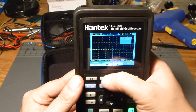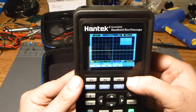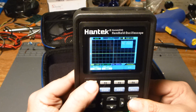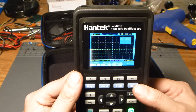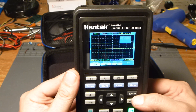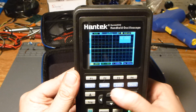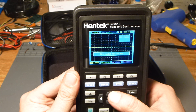For channel one — it's a two-channel scope — you can enable or disable channels, choose AC coupling or DC coupling, or ground. You can also set your probe to 1x, 10x, 100x, or 1000x. It gives you quite a few options, which I was fairly impressed by. This particular one was $115, and it did come from China on a very slow boat. I was all excited to try the waveform generator, pressed the button, and — this model has no AWG.